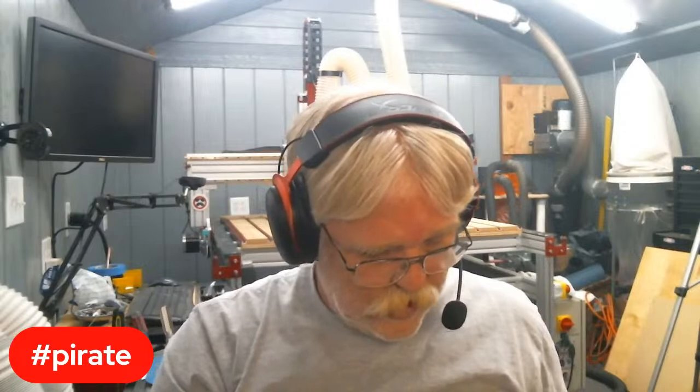I made three passes at 10/1000ths of an inch per pass, which is, let's see what that is, 0.01 inches in millimeters. You'd think I'd know this by now. That's about 0.25 millimeter per pass. And it did this side nice and smooth. This was nice and level. And then there was a little spot up here that it didn't touch. So it did warp and twist just a little bit since I had surfaced it before I started.